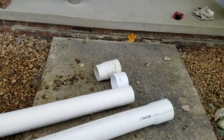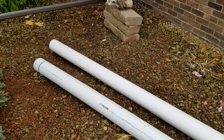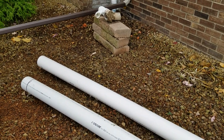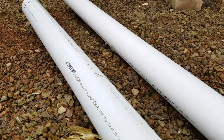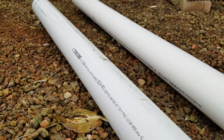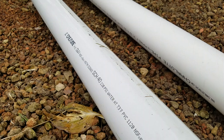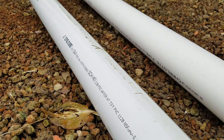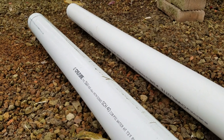I recommend Schedule 40, 4-inch. The old-school guys ran three-inch for so many years — they can't believe four inches isn't too expensive. There is a cost jump when you go from three-inch to four-inch Schedule 40, but when you increase the diameter of a material — whether it's steel or PVC pipe — going from three-inch to four-inch at the same thickness makes the pipe stronger and more rigid. Tree roots tend to take the path of least resistance, so a stiffer pipe holds up better.